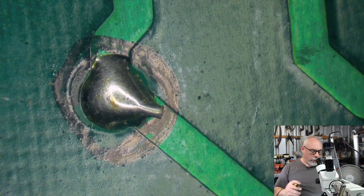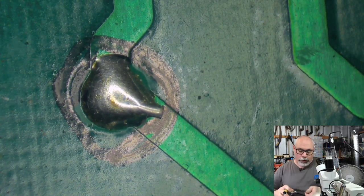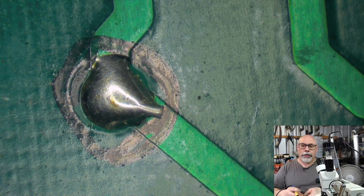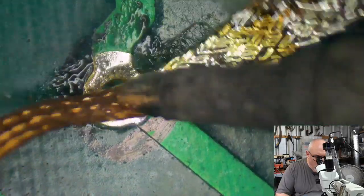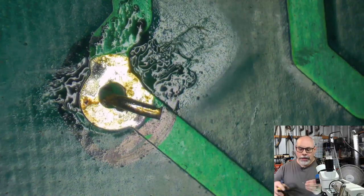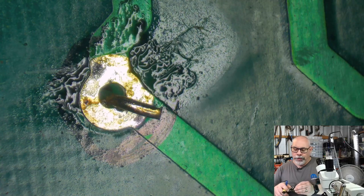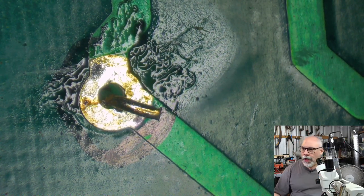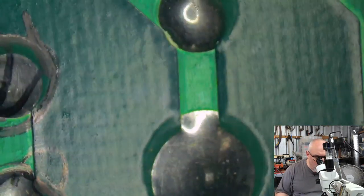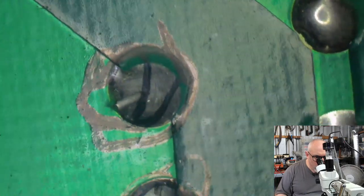As I have said in my streams before, there are a couple of ways of getting the solder off the old pins. One way is, of course, with that solder sucker. Another is using solder braid like this. As you can see, this is braided copper that is impregnated with a bit of flux, and it sucks all that solder up. So let me just put that there.